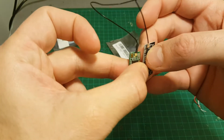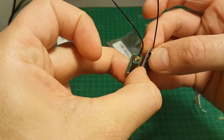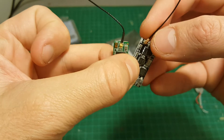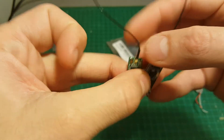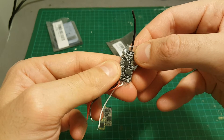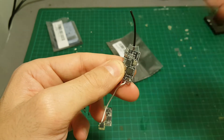Both the XM and the FD1000 have this new type of antenna with a slightly smaller connector than older versions, so make sure you buy compatible ones. Both of those antennas are replaceable. The generic receiver's antenna does not have an IPX connector, so you'll have to solder a new one if you want to replace it.